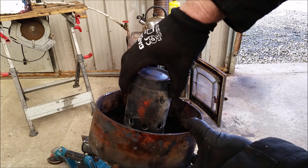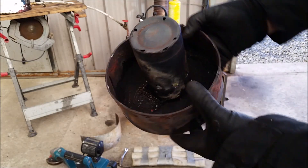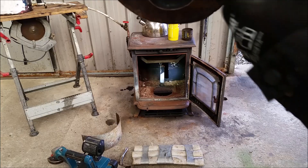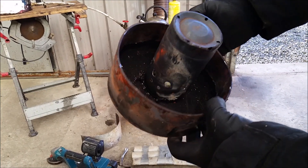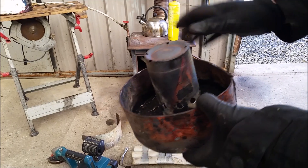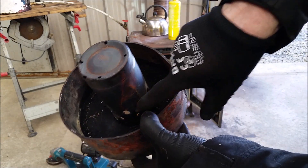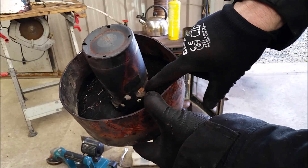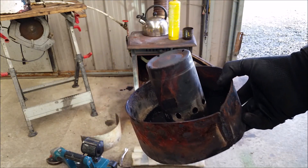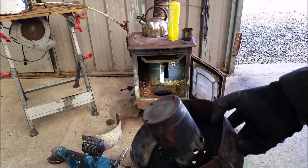I cut a strip about three inches wide, welded it into a ring, put it on a piece of plate, marked around it, cut the plate, and welded it — so essentially I just made a pot. It needed to be mild steel so I could weld it and so oil doesn't drip down. I've got two rows of holes: this is still a work in progress. Last night it was a little smoky so I drilled the holes slightly bigger — now nine millimeters on top and seven millimeters underneath. It's trial and error but the thing works great as is.